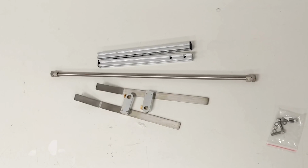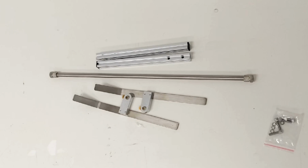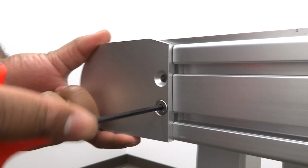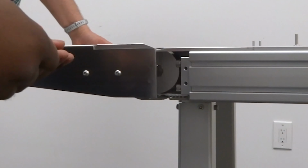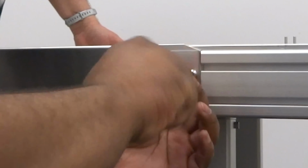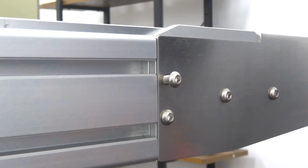Attaching the feeder. Here's the feeder assembly that you'll need to put together in order to feed your material through the T3-OPX feeder tray. Remove the outside edge of the table so you can attach the feeder tray. Have an assistant hold the feeder tray in place while you replace the screws that you just removed. Do it on both sides of the T3-OPX mail table.